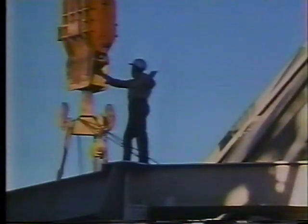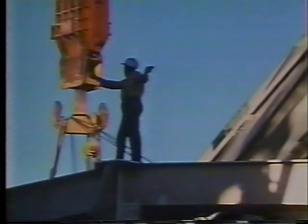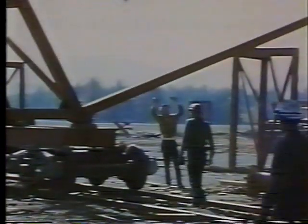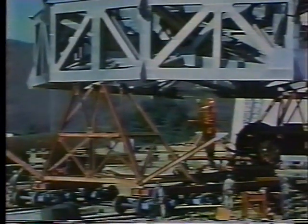The lift involved a calculated overload on both derricks. The lift was started, then stopped to weigh it with hydraulic jacks. Calculated weights had been correct. The derricks were lifting 20% over their rating. They rested with the load. Nothing gave, so the lift resumed. It was followed up with piles of cribbing blocks, insurance for a while, then continued to the proper elevation without backup blocking.